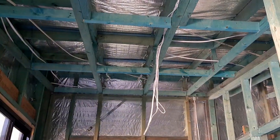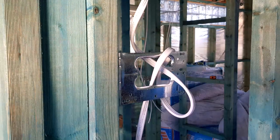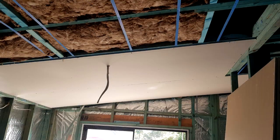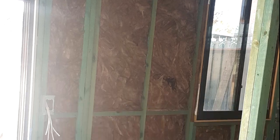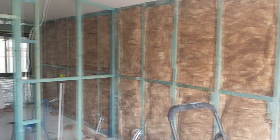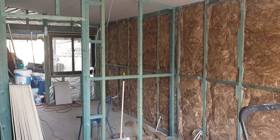The first thing to do was to get the electrics put in place and then I can start working on the insulation and the plastering. I'm fully insulating the house top to bottom so I started out by doing the roof section. The blue strapping you can see there just helps me hold the insulation in place whilst I'm waiting on getting the plaster sheeting put up, and it was really just a matter of working on it section by section until the entire ceiling is covered.